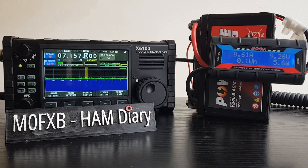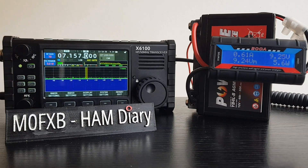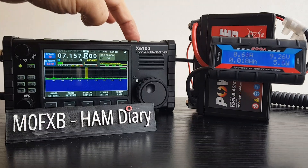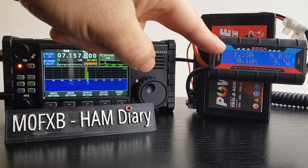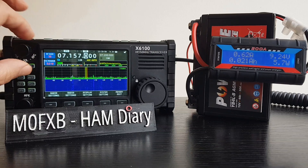Let's try the tuner. We've left it on five watts and we'll mess around with different power settings when we transmit. As it tuned: 1.10 amps, 1.14 amps. And it did tune - I mean, we've literally just got a 40-meter whip lying on the floor, and we're still actually receiving some stations.